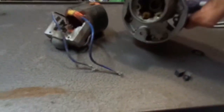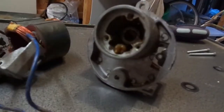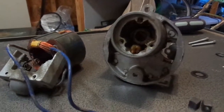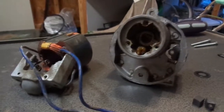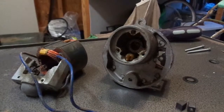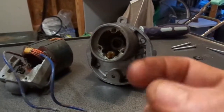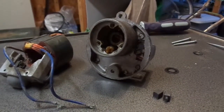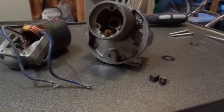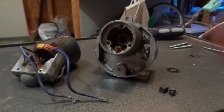All right. So I got the orifice here cleaned out for the gear drive. It had a bunch of old packed grease in there, like really thick, nasty stuff. Basically, what happens to old grease is over time with heat and debris, contamination, things like that, grease will get solidified. To the touch, it's still got some viscosity and some slipperiness, but for what it needs to do, it doesn't really do the trick. Same thing with your window channels, with power windows, if they get seized up, the same thing will happen with the grease over time.